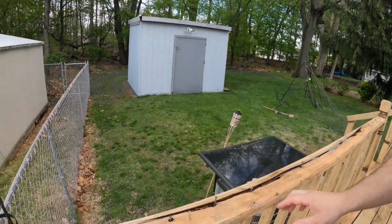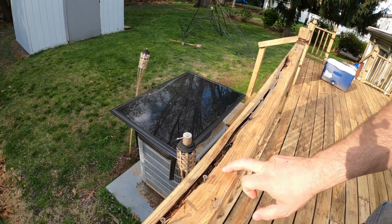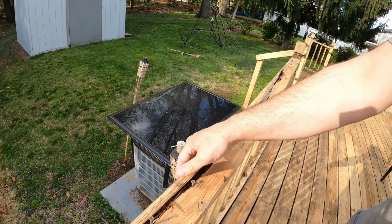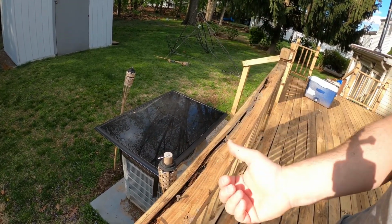The deck over goes on, it's supposed to fill in all the cracks, but it doesn't adhere to the deck or the wood if it's not prepared properly. And this is an example of what happens. The deck over goes on the wood, does not adhere, develops cracks, and water gets into it and stays in there, because it can't dry underneath the actual latex paint or whatever this is.